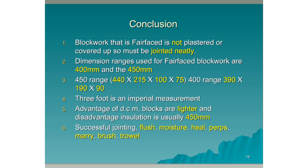A guide for successful jointing. The joints should always be flush before you start rubbing up. The moisture content should be just correct before you start rubbing up. If you are rubbing brickwork you should use the heel of the key jointer. You should always rub the perps first and then the bed joints. All the joints should be married. If rubbing brickwork after jointing, give it a light brush with a very soft brush. If rubbing blockwork, scrape the excess mortar off with a trowel — never brush rubbed blockwork. A few common methods of jointing are key jointing, recess joint, flush jointing and tuck pointing.